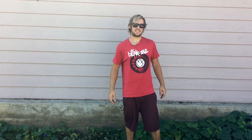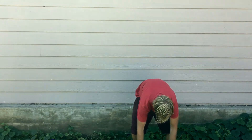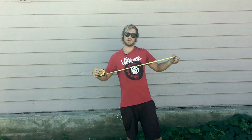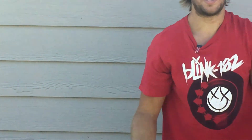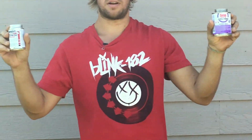When you begin, you're going to need some tools. Don't forget your hacksaw in case you need to cut some stuff. You might need a measuring tape to measure before you cut. You might also need a file — you want to file down those burrs from the PVC before you glue them. And don't forget your glue and your primer. The primer is going to make a much better seal; they go together and work great.